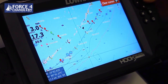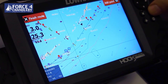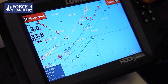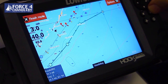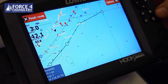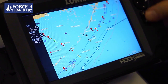To create a route, press the enter button, go down to new route, press enter for your start, select your next point and it draws a line from point A to point B. You can keep entering points - so there are four waypoints joined together to create a route. When you want to finish, the top left corner says finish route, press the X button, then save the route and name it whatever you like.